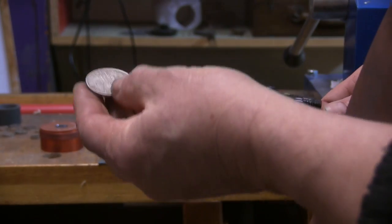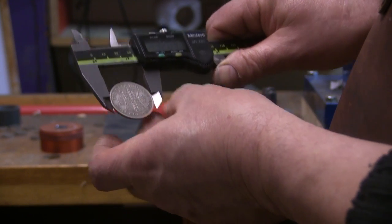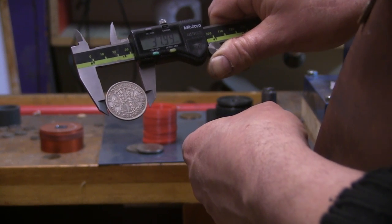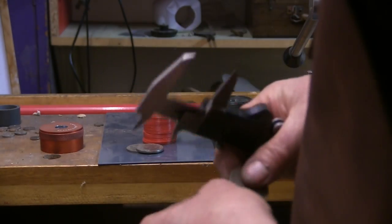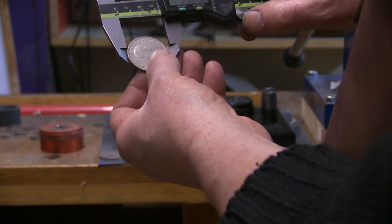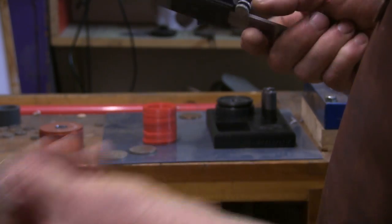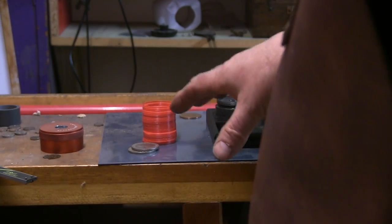This is a 1939, which has got a lot more silver content, and it's just about slightly under 32mm. So coins are never going to be exactly the size they should be. If you look at one coin measuring 32.02 and turn it 90 degrees, it's 31.97 — so they're never perfectly round either. Consequently they may fit in more than one of the spacers.